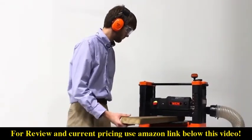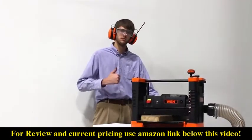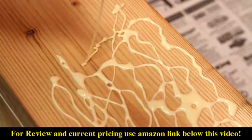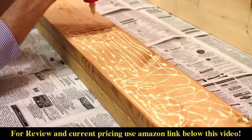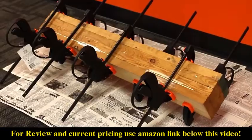Next, while donning your favorite business casual, plane off both faces of the boards so they are nice and flat. After that, glue the faces of the boards to one another with liberal amounts of glue to make sure the entire face gets covered. Finally, clamp the boards tightly to one another and leave them overnight to dry.